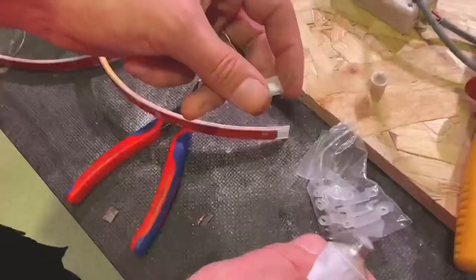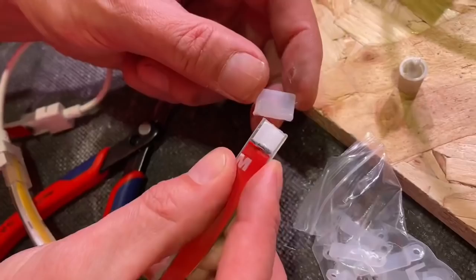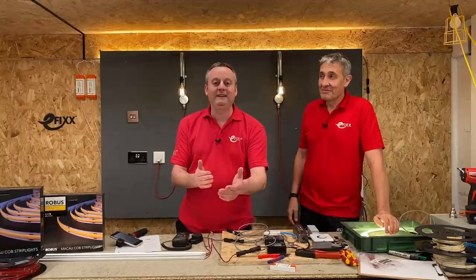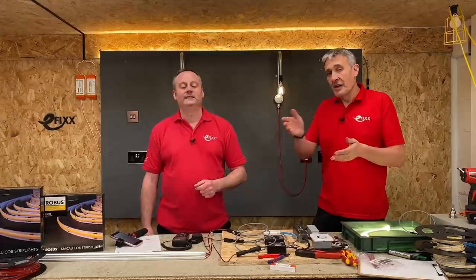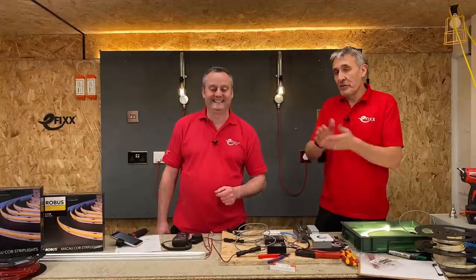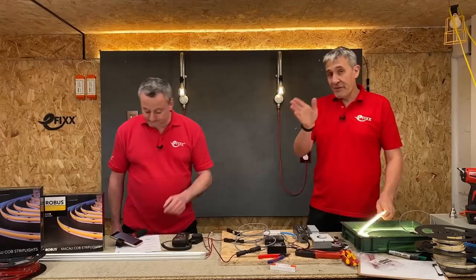Let's finish by putting a silicone end cap onto the end of our Macau LED strip. A bit of RTV silicone in there, push the end cap on. I've removed the tape in the area where I apply it. When I'm faced with IP67 LED strip I'm always a little nervous — hoping the reel is either exactly the right length or I need to shorten it, because the last thing I want is to join it or send it around corners. However this system was incredibly easy. You could solder to it but you'd have to remove the silicone from around the chip-on-board LED strip, access the solder pads, and then re-waterproof it with double-wall heat shrink. Why would you when these insulation displacement connectors are fantastic?